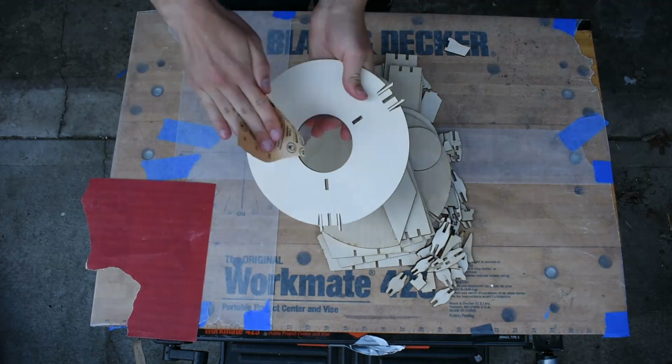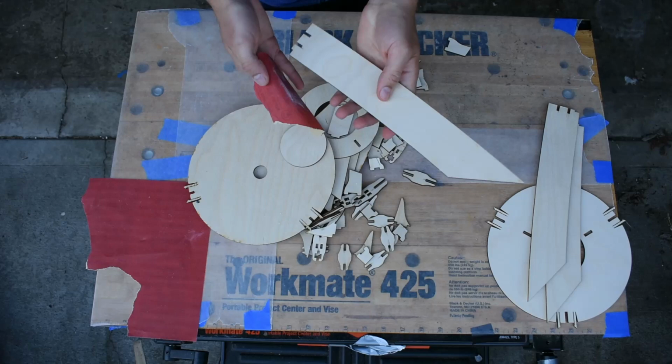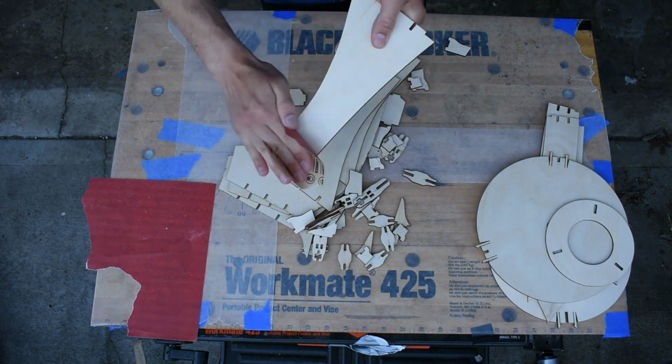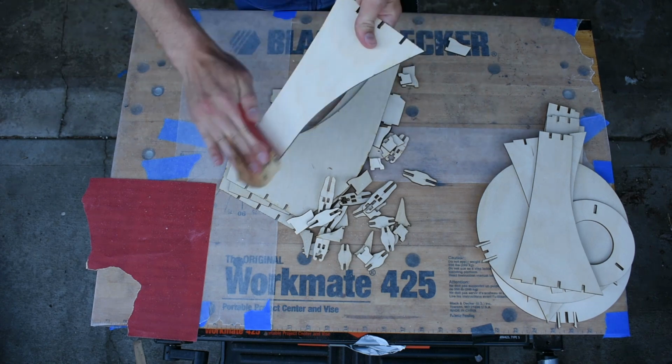The next step in the process is sanding, then staining and applying finish to the wood. This part is optional, however I definitely think it improves the look, and it's a good idea to add a water resistance coating to the tower, because the glass jar on the top that holds the ice water is going to cause condensation and expose wood near it to moisture.